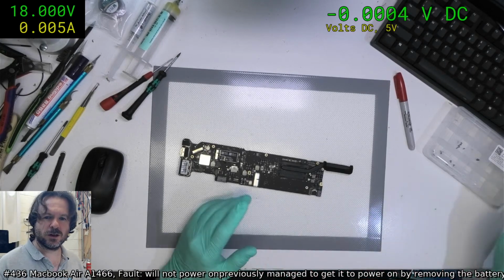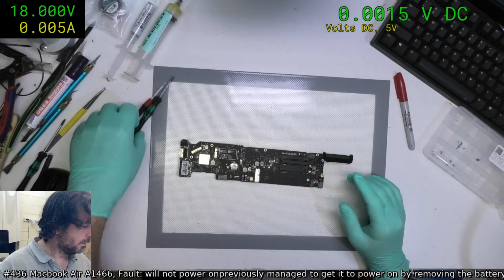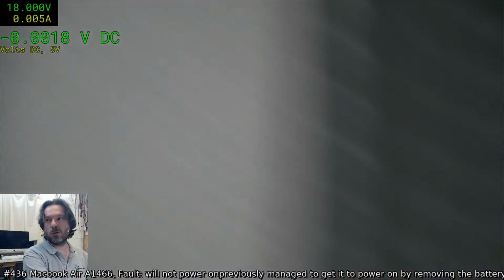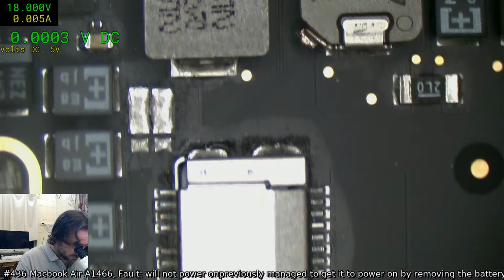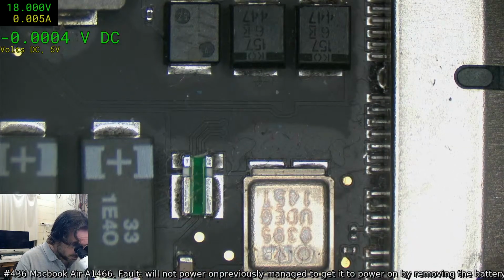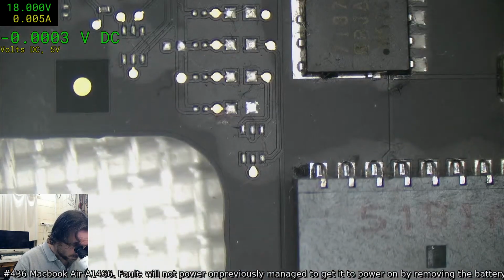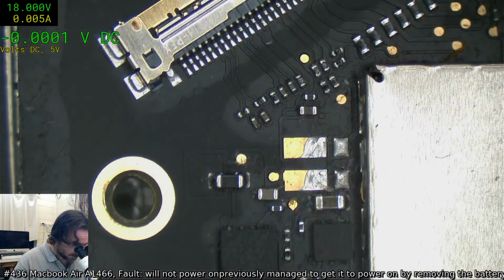Any fix for 708 keyboard keys double click problem? Yep, take it to Apple and get them to change that keyboard. It's pretty much the only thing I can think of. Or spend the money and go get a replacement deck yourself, which will inevitably fail in the future anyway. That's the downside of those butterfly keyboards. You replace them, but it's just going to happen again, ultimately.